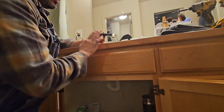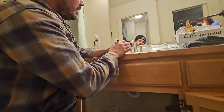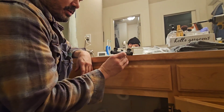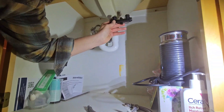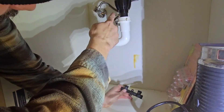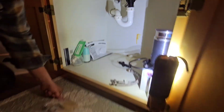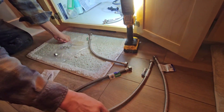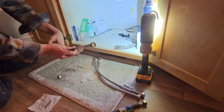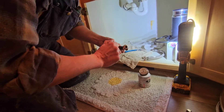These actually work really well — I'm really happy with them. I've installed tons of them and customers are really happy. It took one minute 30 seconds before we installed the bypass valve. We'll see what it does in a little while. We need one long cold water line looping up to one port and the hot water looping up to the other, so we're not going to use the supplies from the kit — we're going to use longer ones. We need a couple of long 3/8 by 1/2 fittings. The seal is made by the rubber washer that's in there.